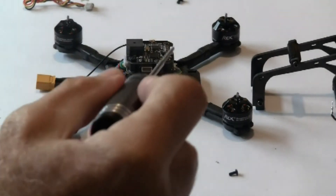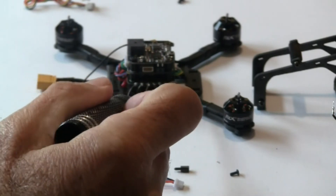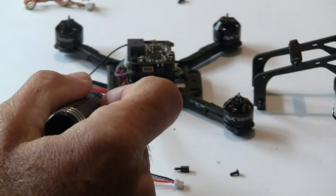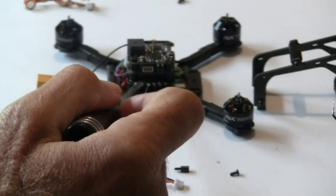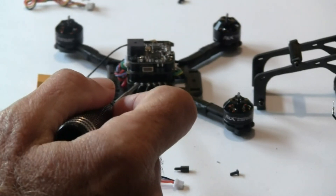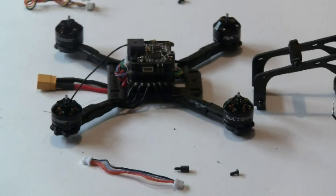The soldering has been fairly simple. The only thing I had to solder on this build is just the motor ESC wires. I wanted to run those through the middle, but there were too many wires to do that. In hindsight, I could have gone through the bottom and soldered them on the bottom of the ESC, but I already had the tops tinned and it looked difficult to get in there. So I just went ahead and soldered them the traditional way coming in. I doubt those cables are going to get hit — it's just not quite as clean.